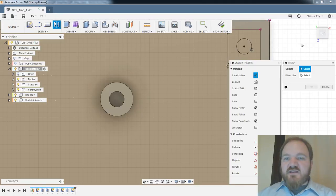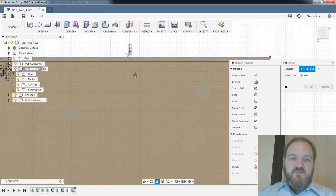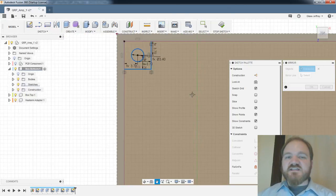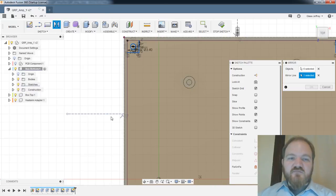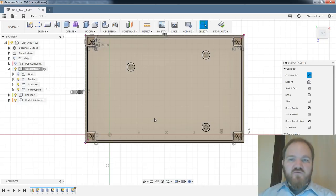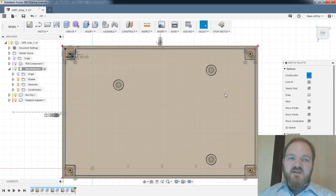And then I'm going to do it again, and I'll have all four posts that are the same, and they're all based on that same geometry. Sometimes I have found, if you're doing a lot of mirroring especially, not so much dimensioning, but with the mirror tool, if you're relying on mirroring a lot, you can get what feel like floating point errors in your placements, especially when it comes to this identify face feature of Fusion.